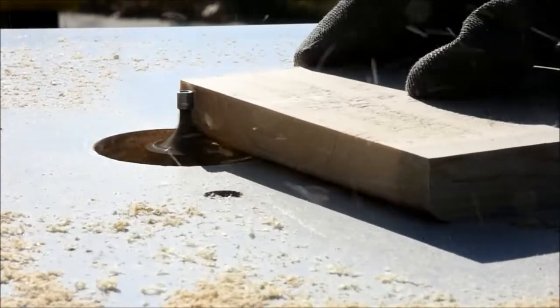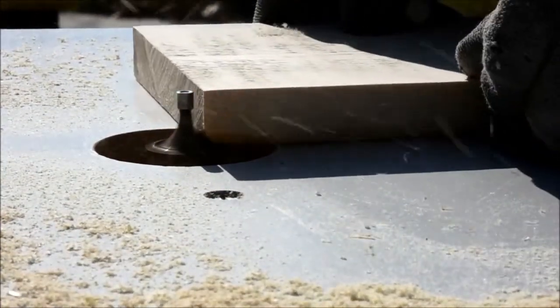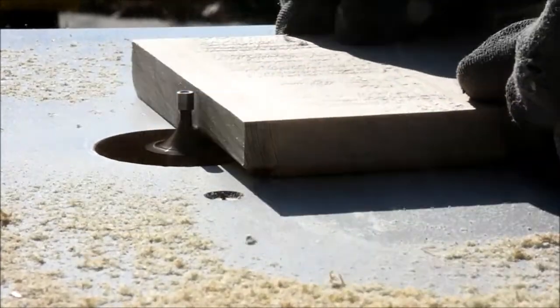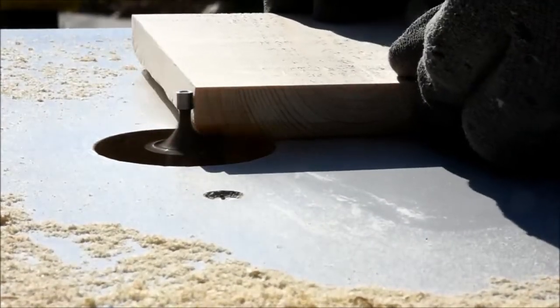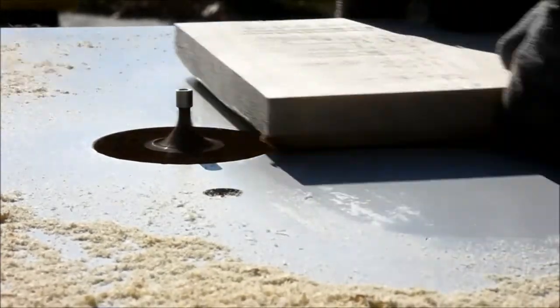I put a quarter-inch roundover profile on the tops and bottoms. On this first pass I just make a skim pass to get the bulk of the material off, and then I follow it with a pass where I'm actually riding up against the wood with the bearing — it's not really a bearing, but it serves the same purpose.